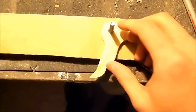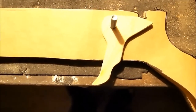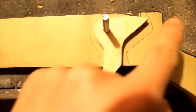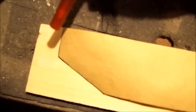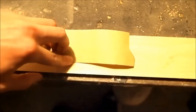Take that piece of paper we used as a stencil for the frame and lay it back down. Use it to trace out the full range of motion of the trigger: start at the point furthest forward, make your mark at the front of the trigger, pull it all the way back, and mark the back. Cut those lines and use the halves as templates to trace onto the poplar boards for the spacers. Before tracing, make a mark a quarter inch below the top on each side and line it up offset — same on the other side.